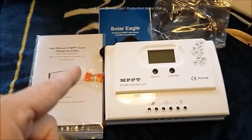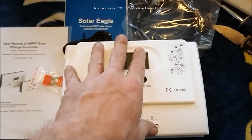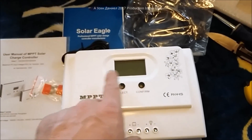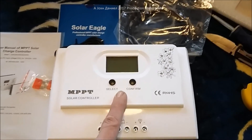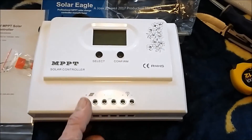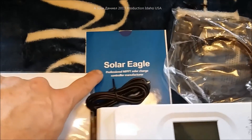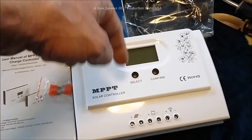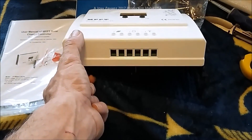The video is an unboxing and opening of a Chinese MPPT — this one is the Solar Eagle Professional. A link is below the video where you can find it. They have numerous options: 15, 20, 30, 40, and 50 amp. I wouldn't recommend the 50 amp, and you'll see why when we look at the fusing and over-voltage settings. The 40 amp is the same identical weight as the 50 amp and heavier than the 30 amp, meaning it has a bigger toroidal transformer. This unit is about $125 for the 40 amp, and it's very good.